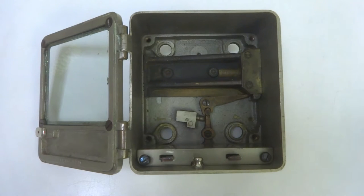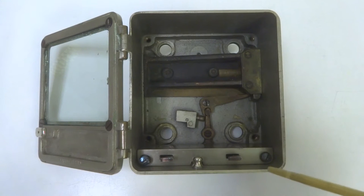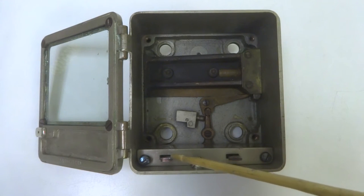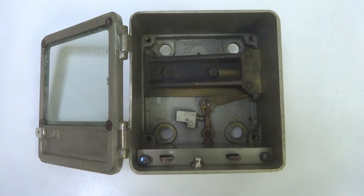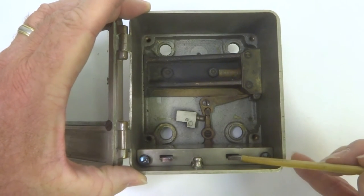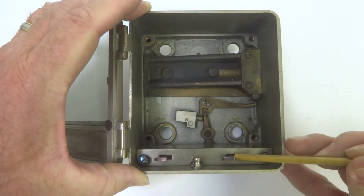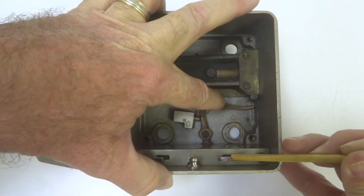What you have here is a little knob — a manual override knob — and here are the two areas of the slide bolt which would engage with the time locks themselves. Under normal circumstances, as the locks would unwind, they would push against this slide bolt here, and as you can see, it would fall down here.